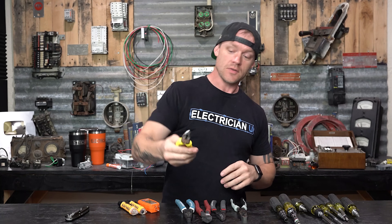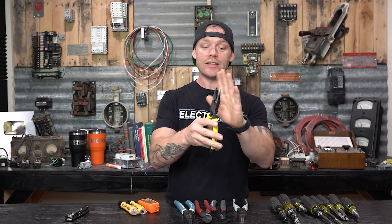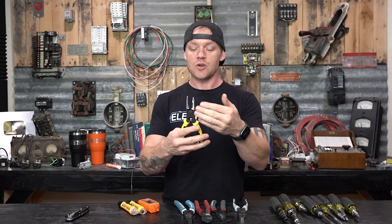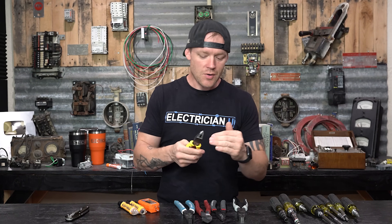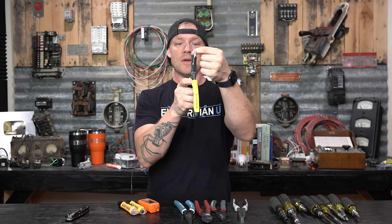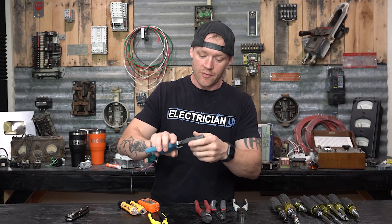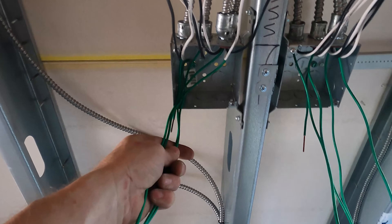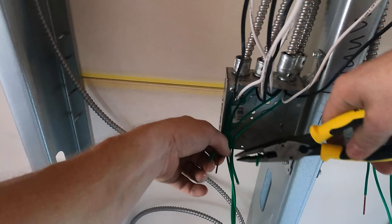There's another really good one — these needle nose. They're kind of a combination, very similar to both of these, except these are definitely lineman's first with a little bit of needle nose. This one is strictly needle nose — you're not going to be twisting joints with this — but it does have a stripper, bolt cutters, and a crimper. Personally, I find it's harder to strip with: you have to really hang on to the wire and pull the tool. The stripping is done in the center of the jaws, whereas on the others it's on the outer edge where it's easy to see and sharp and you can just clip down and pull the wire off easily. With these you have to pinch down and wiggle the handle a bunch to get it loose — I don't really like this as a stripping tool.